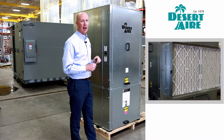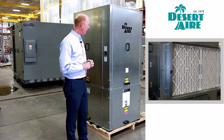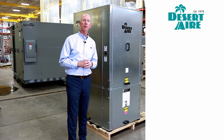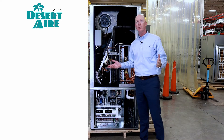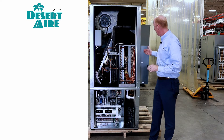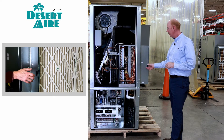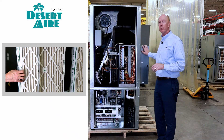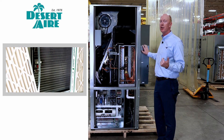The intake is going to be on the opposite side — that's going to be our air return from the space. Let me get the doors off and we'll take a closer look. Now with the cabinet doors off, you can see a closer look at the inside of the unit. This is going to be our intake coming back from the room. Filters are here — they're replaceable through this little panel. Four-inch pleated filters; anything commercially available in a four-inch filter we can certainly utilize for that return air filter.